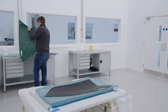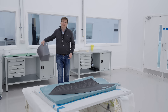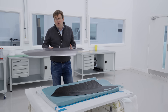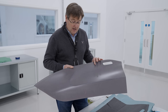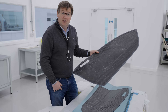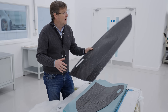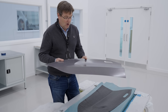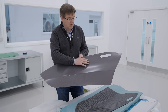One of the things we've been developing over the last couple of weeks is the recipe for both the structural and non-structural panels needed for various parts of the fuselage. This particular test panel has the carbon fiber in the required number of plies and orientations, and on top of that we've got the copper lightning strike mesh that you can see.